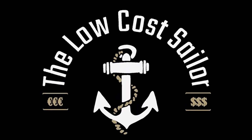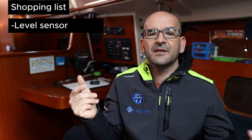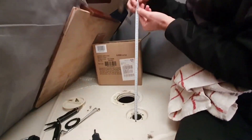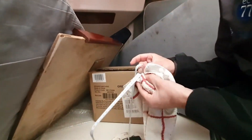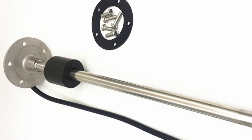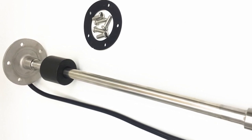Let's see what we'll need and start with the shopping. To get our installation up and running, we are going to need two fundamental parts. The level sensor itself, which will be the piece that goes inside the tank — we will buy the right height for our tank, so before buying the sensor, measure the height and choose one a little smaller than the available height. I have chosen sensors with a vertical float design, which seem to be the most reliable as they have no mechanical parts beyond the float itself, and are identical to those in any nautical store but cost about half as much on AliExpress — mine cost about 10 euros each.